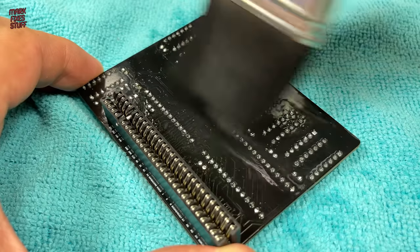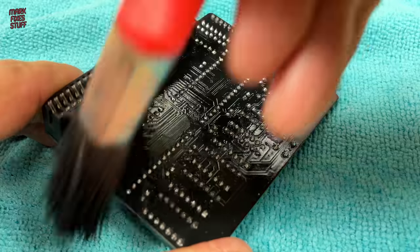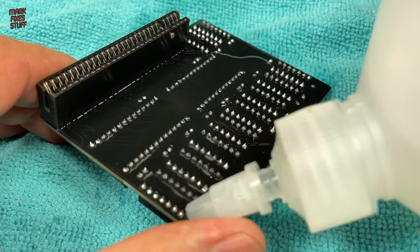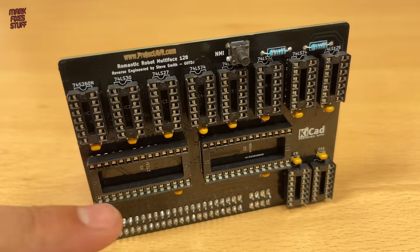Well, fluxes contain acids. No clean just means that after use, the acid is burned away enough that it won't corrode the board. Stronger fluxes must be cleaned or the workpiece will be affected over time. In real terms, it's just telling you that the flux becomes inert after use. It's certainly not telling you that it's presentable.